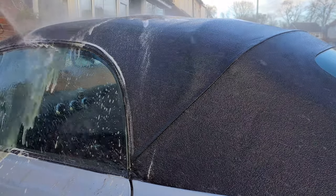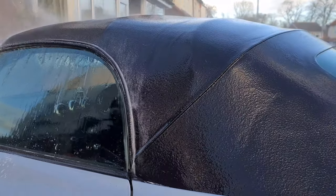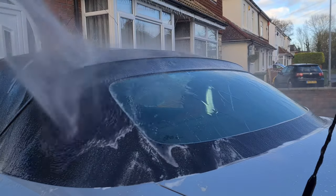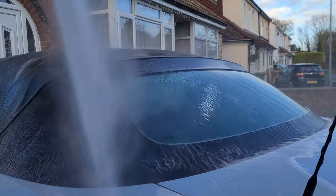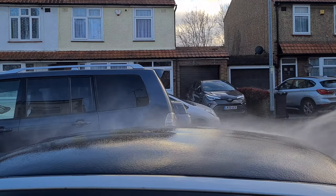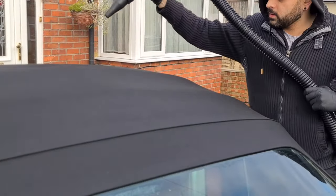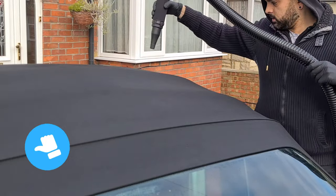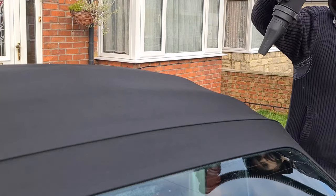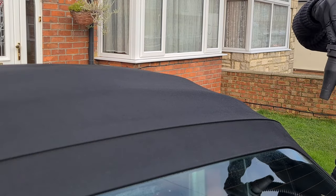Now time for the rinse. You can see the mountain of green dirt coming off — that formula has really done wonders pulling the green moss and algae out of that roof. Use a light pressure washer at very light pressure so it won't cause any lines. Use plenty of water as these roofs are like a giant sponge. Once rinsed, towel dry it, then use a blower to get the last moisture out, and leave it to air dry for a couple of hours. Pay close attention to all the seams to make sure all the product and dirt is out.